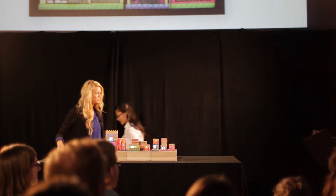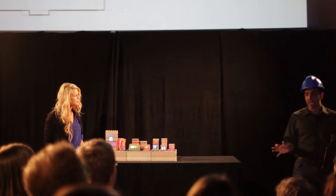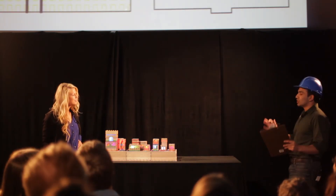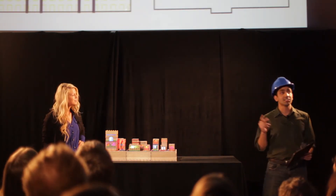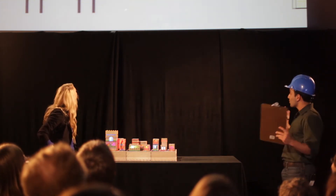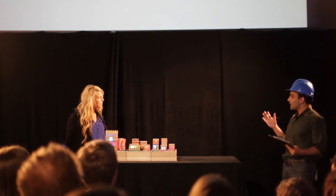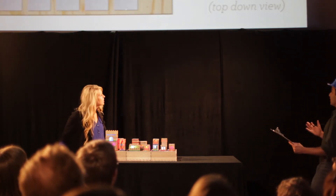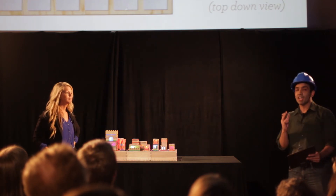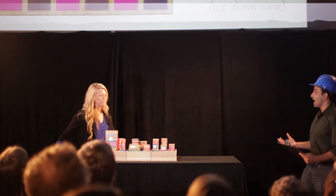Alright, this part's a bit technical, you might think it's dry, but I'm going to explain the electronics inside. The rectifier bridge and resistors are key, because they both get soldered to two LEDs. The LEDs then get wired to a board. The wires are exposed but equally spaced — meaning they align with metal rails placed on the baseboard design. The rails alternate between five volts and ground, and the blocks light up when the wires touch down.